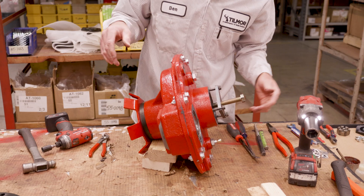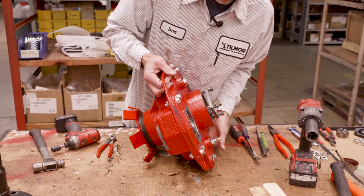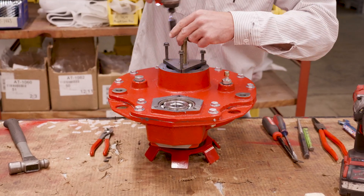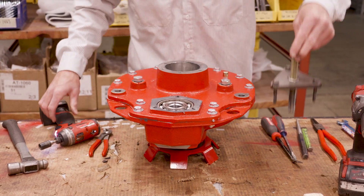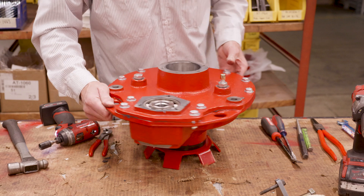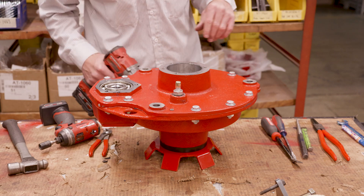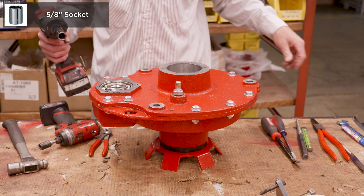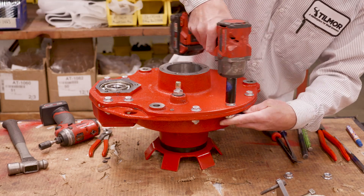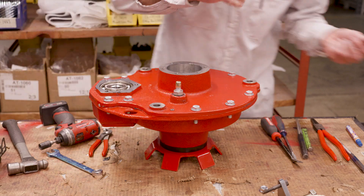Okay, that is out. Let's set it back up on the spindle protector. Get that off of there and lay it to the side — we will need that again. Go ahead and get your washer out of there. Now what we're going to do is remove all these bolts so we can separate these cases. The bolt head is a 5/8ths and the nut on the bottom is an 11/16ths — go ahead and remove all those and collect them. You can reuse these when you're putting it back together.